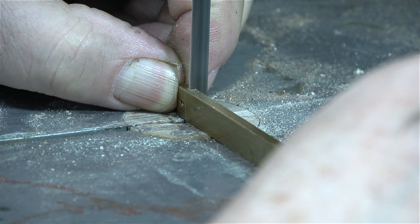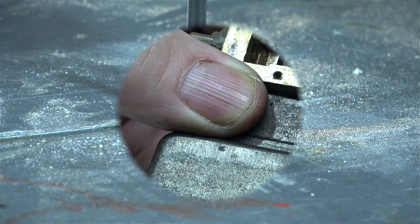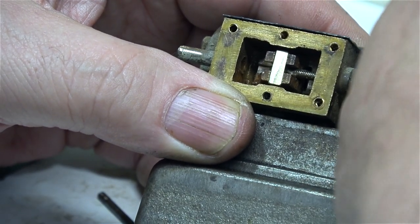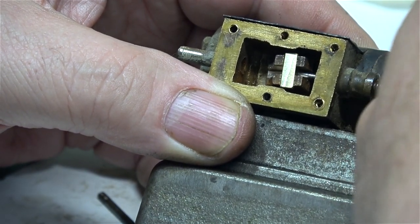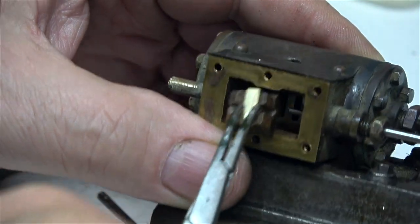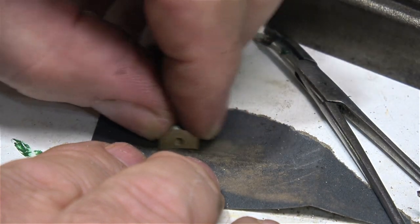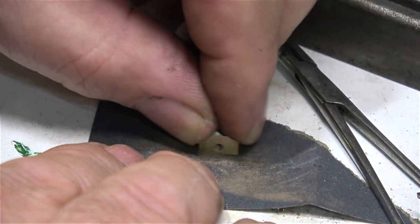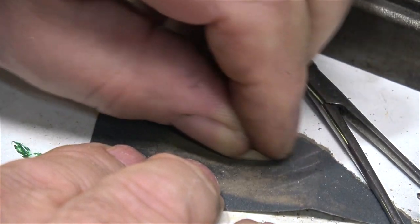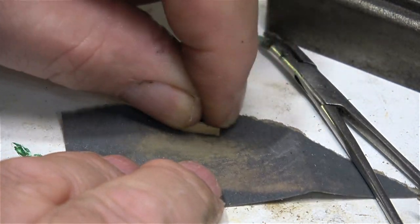Notice I'm cutting the piece of bar on its side — this makes sure it is at 90 degrees to the saw blade. The next part of the job is to do a test fit of the assembly in the steam chest, but in my opinion the drive block is a little bit too tight on the valve. So it's over to the wet-or-dry sandpaper method to remove some metal. It just needs to be a very easy fit in the slot in the slide valve, and this will allow the pressure of the steam to hold the valve securely against the port face.